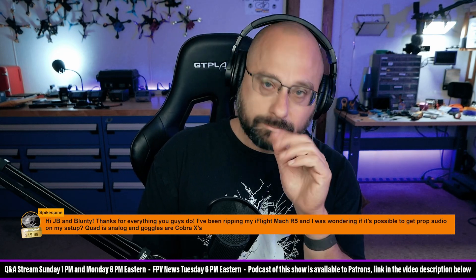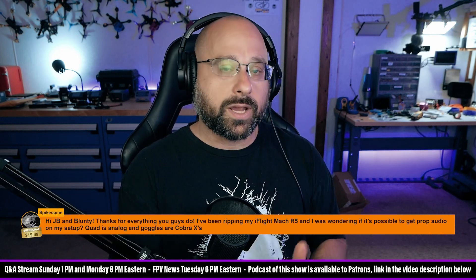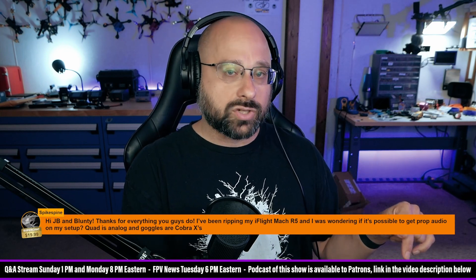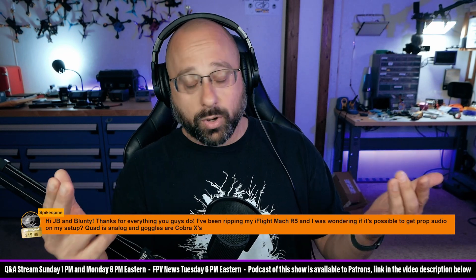The final thing — and I'm on the edge of my knowledge here, because I don't fly with audio, so please take this with a grain of salt — the signal has stereo audio. It has two audio subcarriers, one for the left and one for the right channel. FPV video transmitters don't transmit stereo audio. What they will do is pick either the left or the right subcarrier and broadcast audio on that subcarrier only. So if your receiver is not listening on the same subcarrier that your VTX is transmitting on, you won't get audio. I think this is a pretty rare issue, but I have seen cases where both the video transmitter and the receiver module supported audio, but no audio got through.